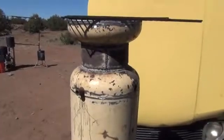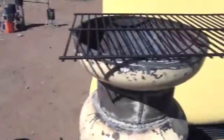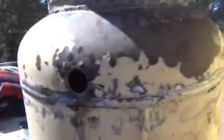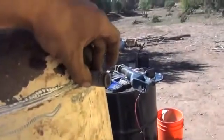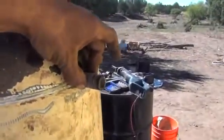A quick update of where we are in this thermoreactor unit. You can see the grate screen that I'm going to cut down so that it'll fit right up on top of our reduction bowl. That'll be the final stage of the burn, and material will have to fall through the screen into our ash catch down below. You can see these holes that I've drilled in there — I put four holes so far. You can see these pieces of pipe already on two sides that I've cut and measured, threaded in at the moment. What I'll probably end up doing is unthreading them now that I've got my measurements, and welding it the other way around so I can always unthread the pieces — it makes it more manageable if you ever have to take it apart or clean it.